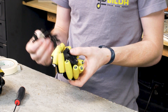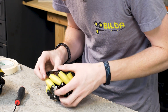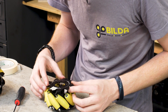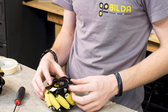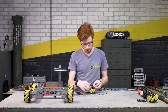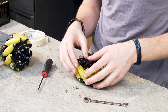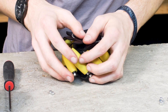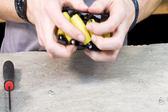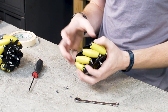Here's where we use those tape marks as references. Find the tape mark on the wheel and on the plate and line them up. Rotate the plate directly over the pieces of threaded rod, start by putting one hole onto a threaded rod, then go to the next hole and work your way around the wheel, flexing those rollers into place and making everything aligned. Check that everything has those shims and will line up right — once enough rollers are lined up it should all snap into place.